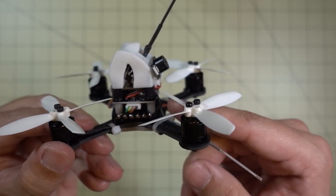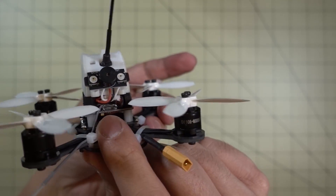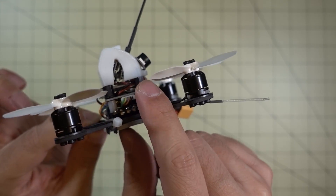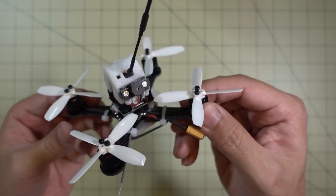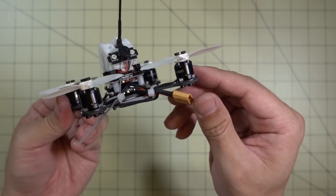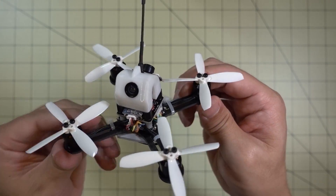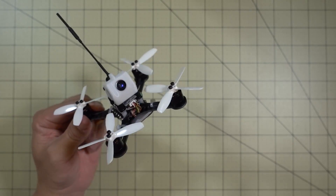I also rotated the board — it was rotated 45 degrees originally — so that the USB port comes out the back, meaning I'll need to adjust that in Betaflight settings. Other than that and the four nylon screws going from the bottom up to the hex standoffs, everything is exactly the same parts. I'm now using Rotaryx 2535 props instead of 2-inch props, so I can run this on 2S for MultiGP racing and probably 3S as well. I'll be testing both later in this video.